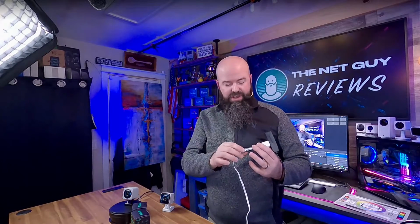Now, if I do the siren, again, headphone warning if you guys are watching, I'm just going to watch it here. I'm going to see if adding the sound also bumps this up. It did. It's going about 700 milliamps. So I turned the siren off. Sorry, guys, for the headphone warning there. But yeah, the maximum draw that I saw in here, if it'll track that, was 700 milliamps. So it's not even a full amp, which is what this is providing.